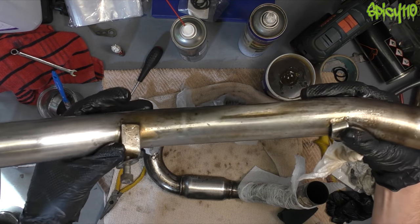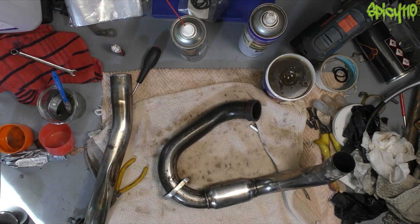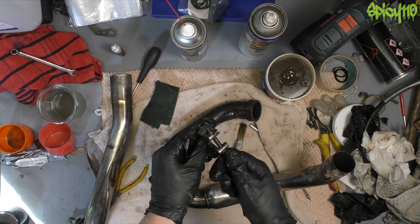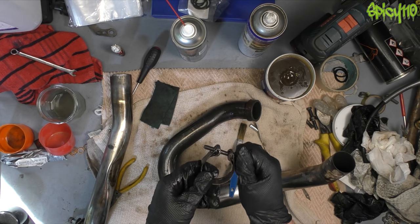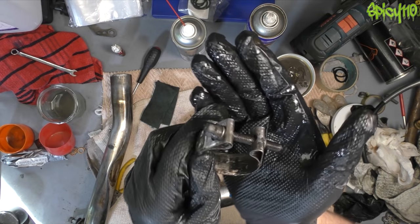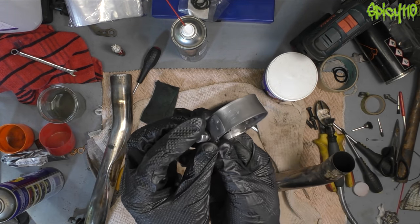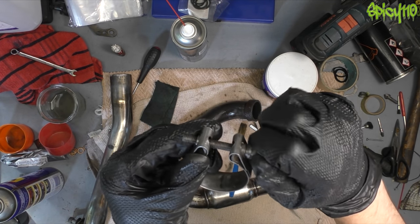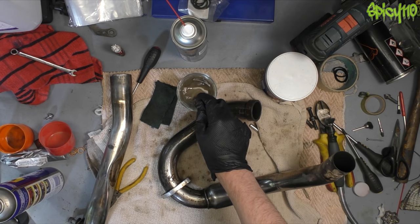That's the first coat done, and as you can see that's coming out nicely. It appears to be attacking the rust. I'm going to do what I did with the other piece — use a scourer and a bit of the acid and basically just scrub it, and then once I've got most of it off I'll go to using sandpapers. One completely free-moving exhaust strap — it just needs cleaning up a bit more, but that's done the trick. I'm going to neutralise this in water, just rinse it. As you can see, that has taken off a lot of the rust. I'm going to start to wire wheel it a bit, then give it a quick buff on the buffing wheel — one cleaned up exhaust band, working perfectly. I'll rinse these towels in a lot of water later to get rid of all the acid — you can neutralise it with water.